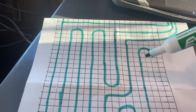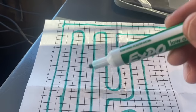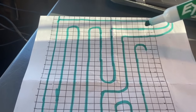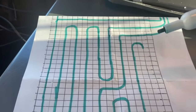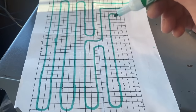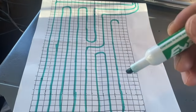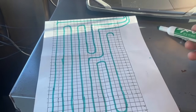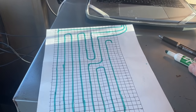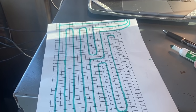So when you're doing this, you got to realize, okay, this loop is 400 foot, but it might not cover as many 40 foot lengths as this one, because you had to run this long 30 foot run to get way over to here. So the same thing applies. We're gonna go down, we're gonna start this loop, go all the way around, boom, boom, boom, back up, and just keep running it, maybe it's not 40 anymore because we lost this section, but whatever this length happens to be, you're just gonna keep running it now until, you know, my 1,000 foot roll, I want to say 200 foot now, because I cut 400 foot off of it, so my 1,000 was down to 600, and now I want to put another 400 foot loop in.